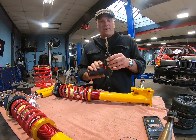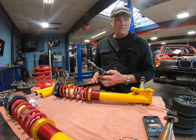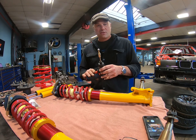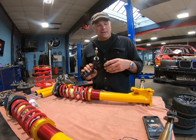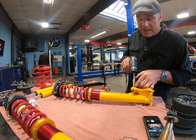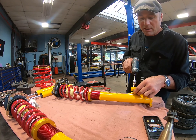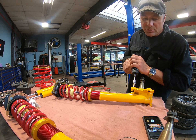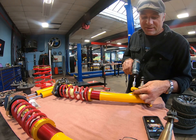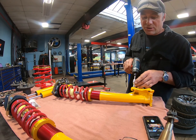We're going to take this thread chaser on the light duty electric drill at a lowish torque setting — maybe half or two-thirds of the available torque. As I'm using the tool I'm judicious with the throttle: you start off real slow, make sure it's threaded straight, then run it through to make sure there are no messed-up threads, paint in the threads, or any other contaminants that are going to cause a problem for a bolt going through it. You can see it's going through nice and smooth. Truth be told I've already done this once — it's something I always tell people to do and they look at me a little cross-eyed, but it saves a bunch of grief down the road.